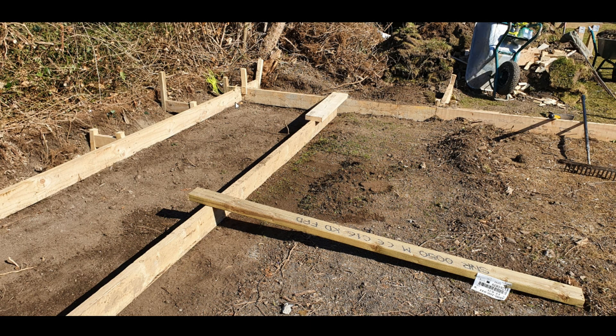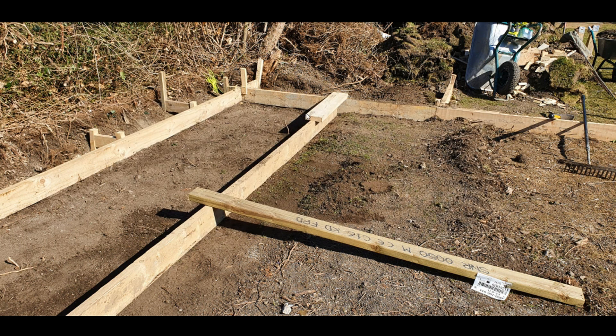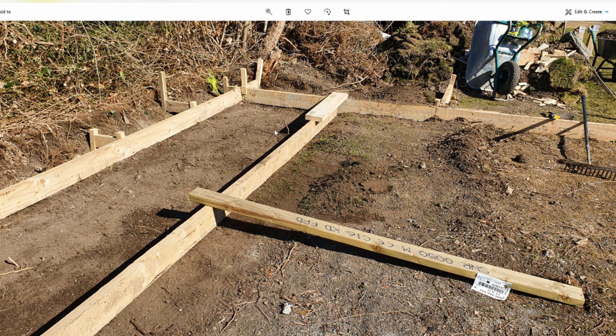I'm going to make sure it is genuinely six inches deep. The guy who priced the concrete said he'd do seven inches, but I didn't have any gravel to backfill it, so it's a little bit harder to get it flat. I've heard a few people mention doing insulated concrete — going down another two inches and putting in a two-inch foam insulation — but the temperatures don't change so rapidly that you get much condensation. There will be a damp proof membrane, but I'm not putting any insulation in. It's handy if you do that below concrete, like if you have underfloor heating — it retains the heat and keeps it constant. But for a garage, no, I don't need that.